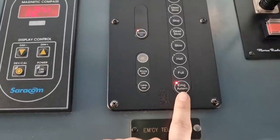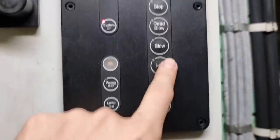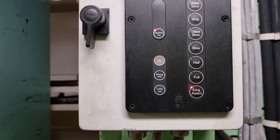This is the problem — after the reset we still got the emergency astern command even though it is not being pressed. I'm going to remove the wiring again. The reset was not successful; we still have this emergency astern and it is persistent. What I am going to do now is go to the engine room, check the counterpart emergency telegraph there, switch off the power there as well, and then put the power back. After resetting the system we still have this emergency astern command from the engine room side, so I will accept this alarm and go to the bridge.